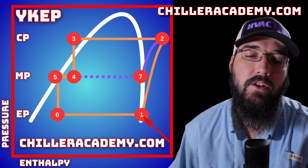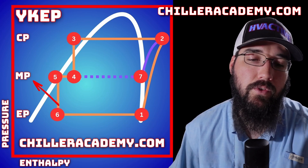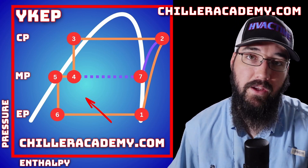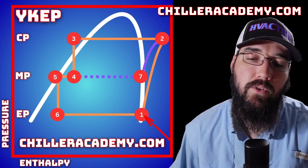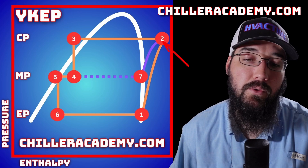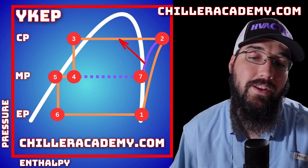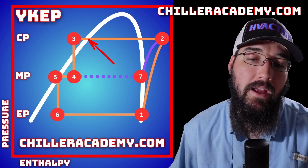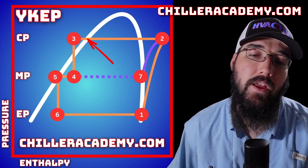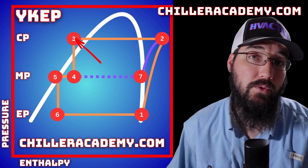This first point here is where we would be leaving our evaporator as a fully saturated gas. This arc here indicates our point of saturation: over here we are subcooled, over here we are superheated, and in the middle we are in a state of saturation, meaning we're transitioning between a liquid and a vapor — the latent heat side of the refrigerant. We go from point one to point two, which is our discharge side, and we leave our volute coming into our condenser at point two. First we de-superheat that refrigerant coming into the condenser, then we fully condense it as we drain over the tubes and get to the bottom, where it begins to stack as a column of liquid. Point three is the refrigerant leaving the condenser and flowing down into our first stage metering device entering into our flash tank or economizer.